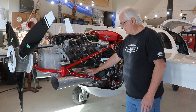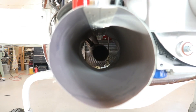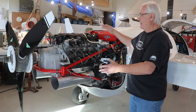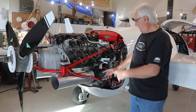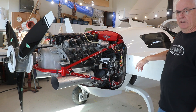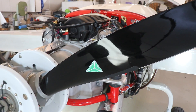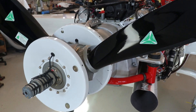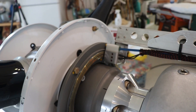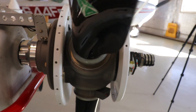The most important thing I did was these big tubes. The exhaust pipe ends right about here and this becomes an augmented exhaust tube — it makes it a jet pump that sucks air. When completely cowled, the only way air can get in is through the radiator, so it sucks it through and cools the engine. The propeller is made in Germany — it's an MT prop, a fancy unit with variable pitch. There's an electric motor right on the back of the propeller hub that controls the pitch — coarse or fine — so the engine and propeller are matched at all times.